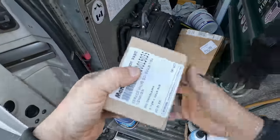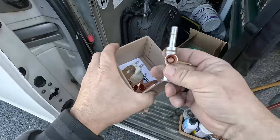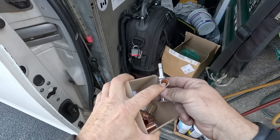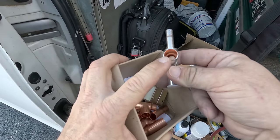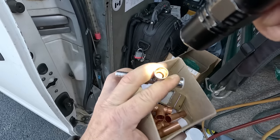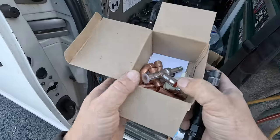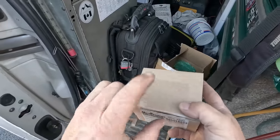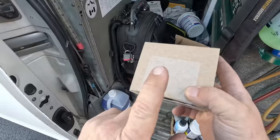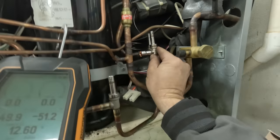Here's our new valve — it came with multiple different copper fittings. You can see right there there is a screen in front of that, which looks like it's there to help catch debris coming through so it doesn't get stuck in the valve mechanism. I have a funny feeling somebody didn't use nitrogen and it's probably gummed up full of charcoal crap. It looks like it's the right one — better to get it apart than not be the right one.